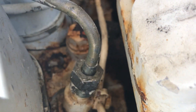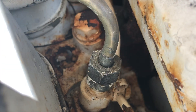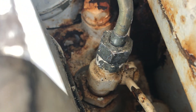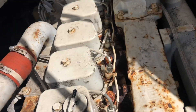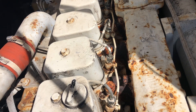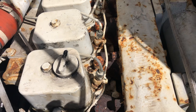There's one there, one there, one there — six total. It's not an excessive amount of fuel; it's very small. Typically on a boat you're going to have off-road diesel in here, so it's going to have a bright red tint to it. You'll want to see that coming from every single one of them. It's best to have a good hot battery for something like this — a quick-turning engine helps.